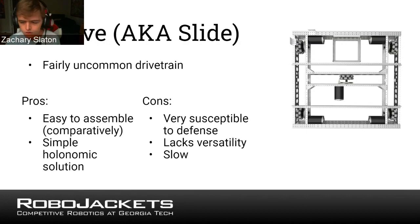This allows the robot, if it's pushed from the side, there isn't enough grip to stop it. So when this robot wants to move side to side, you can power the center wheel either going left or right, and then the whole robot will slide that direction. And then when it's just going forward and backwards, the center wheel, since it's also an omni, just doesn't stop it.